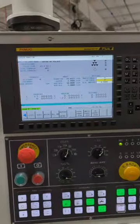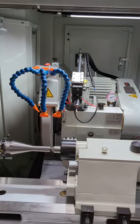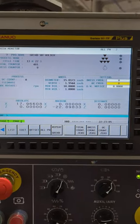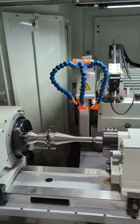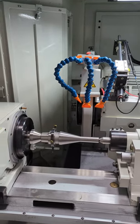I'm going to keep this video basic, because a lot of this should be provided by your wheel manufacturer. They'll provide your surface speed, and a lot of times a process will be worked out ahead of time: what parameters you use, depth of cut, speeds and feeds, work speed, that kind of thing.